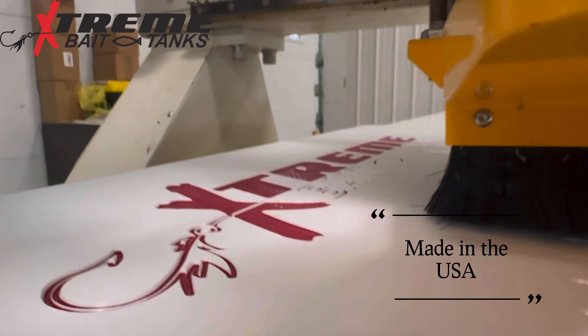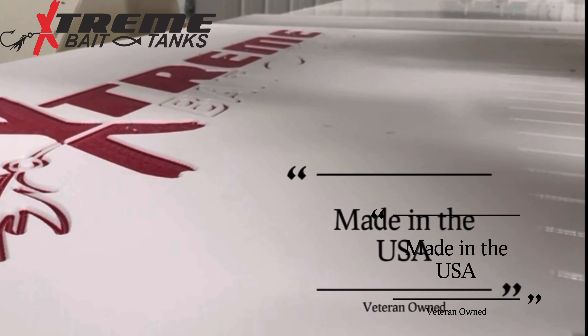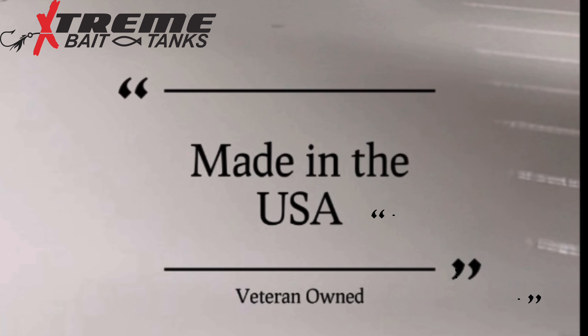In here's where the magic happens. We get all of our flats — our eighth-inch material for the walls, half-inch for tops and bottoms. There's our router where we custom cut everything, and then we shelf the pieces. What Vern's doing over there is the welding process. It's a multiple-stage process. The first thing we do is put the inside wall in — there are two walls, an inner and an outer — and this line here is where the second wall goes in, creating that one-inch air pocket. Once this wall is put in and welded, we soak it in water overnight to ensure a watertight weld. Here's an example of the two walls together getting ready for the cap. This is the time that we add drains, because we have to put a hole through an air pocket. And what Vern's doing here is welding the wall that separates the bait from the filter area.